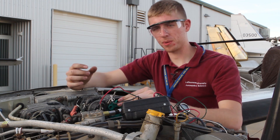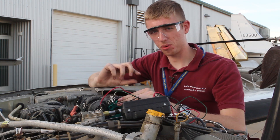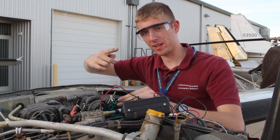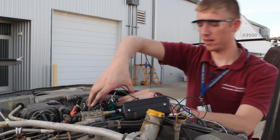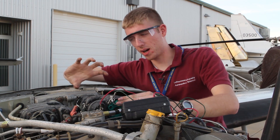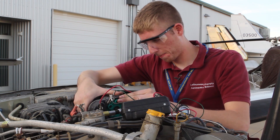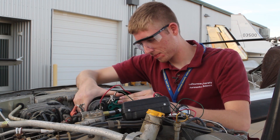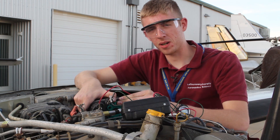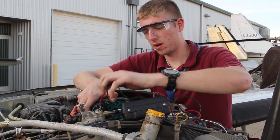So I am rotating it in the proper direction. According to the data plate, this is a right rotating magneto, which means the gear rotates right when looking from the drive end. So from your view I need to rotate this magneto so that the gear in the drive is turning right. This is the position we want — now it is in the proper time position.